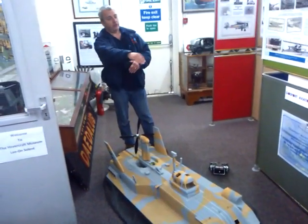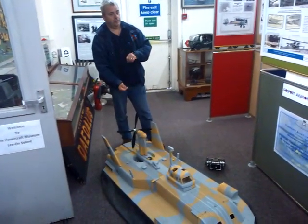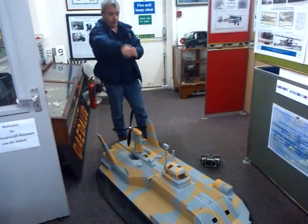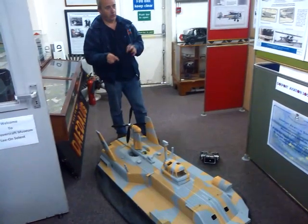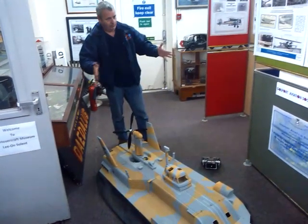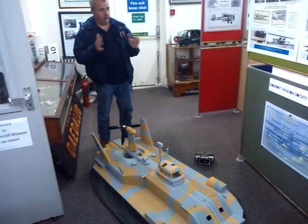The length is a sixteenth, the width is a sixteenth, the height is a sixteenth. So if it was a half scale, two by two by two — it's two times two times two, so it's an eighth of the weight. Because the weight is obviously defined by length, width and height. So not everything scales directly as the scale.